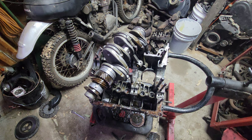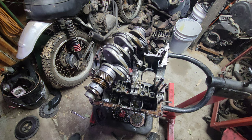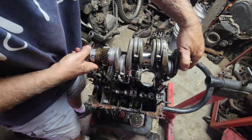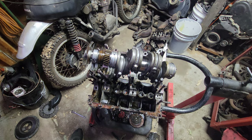So we'll look at the pressure relief valve, stuff like that. I can't remember how the oil flow goes on these, on the single relief. But I think it just goes through the oil cooler. And then as it reaches full pressure from going through the oil cooler, then it relieves to the main bearings. So it starts with the oil cooler is the way I understand it. It goes through the oil cooler priority. Then as soon as it reaches full pressure, it bypasses to go to the main bearings. From the charts that I've looked at over the years, but maybe I'm wrong.